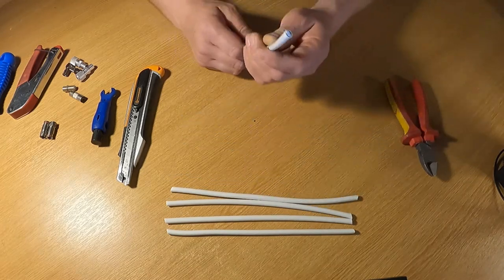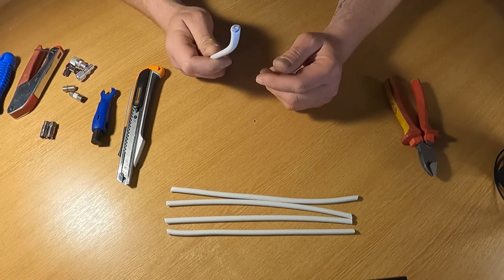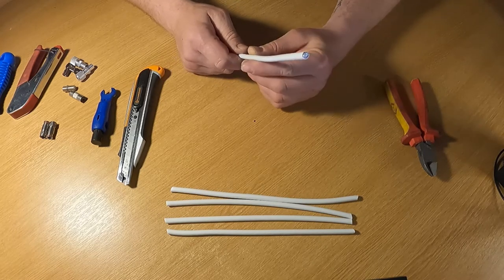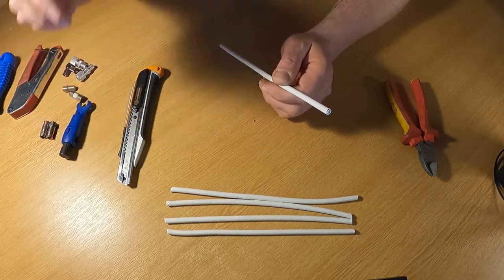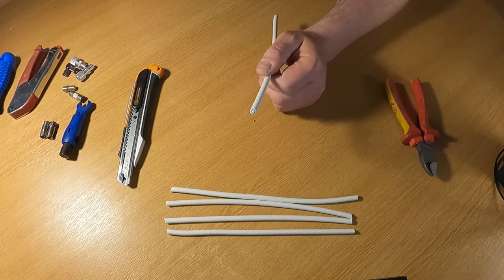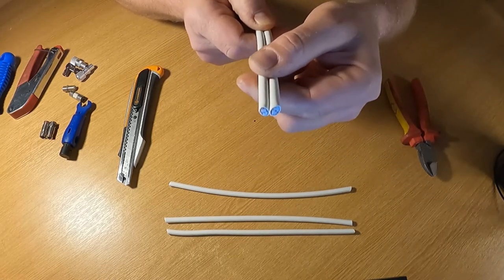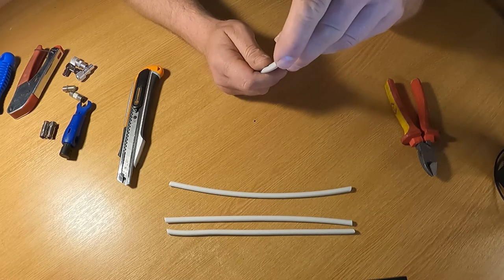So first, describing what we've got. This is coax cable, the TV or satellite cable - the regular thickness that your TV aerial signal comes down. If you've got Sky or satellite, you'll often have two cables glued together. If you've got Sky Plus or Sky Q from at least the past ten years, you'll have what's known as a shotgun cable - two thinner versions glued together - with two feeds coming from your dish into your satellite box.